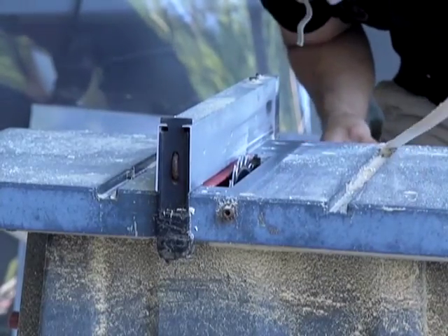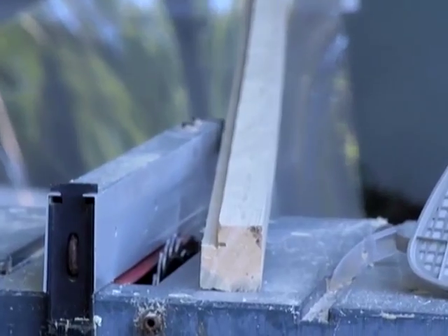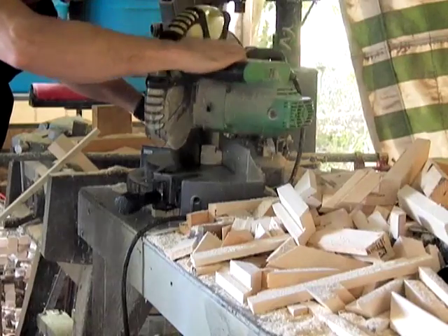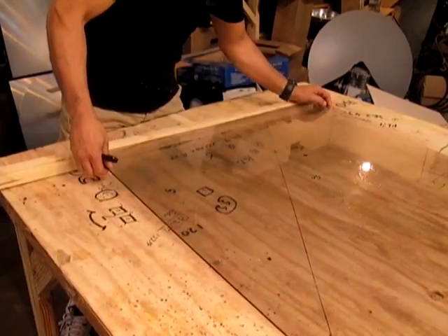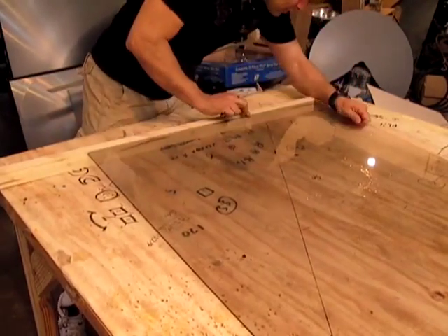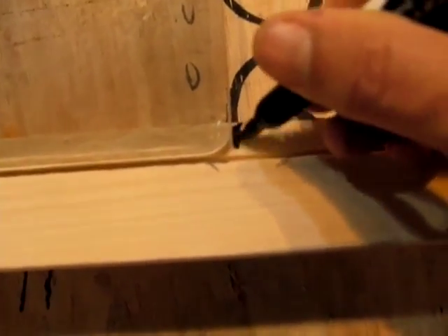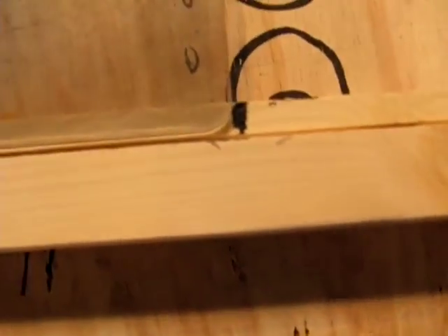You start your miter at 45 degrees, take it to your edge. You don't want to go to the farthest out point. You set your glass on there and then you pull your glass — you want your edge to have just a little bit of space. You don't want it to go right to the very edge, so you want it as close as you can get without it being too much. When you come over to the end, you're going to mark your wood — just put a nice line right there. You'll notice that's just past the outside, so you're going to leave a little bit of black behind, and that'll give you the same thing on the other side.